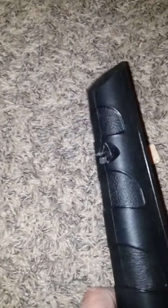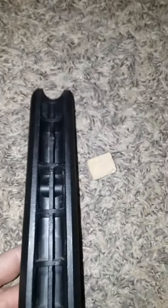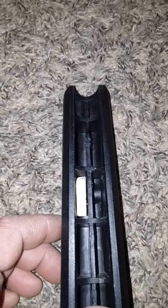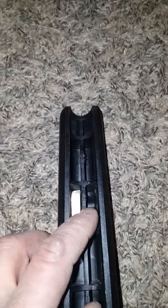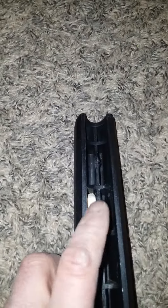I got these little chunks of wood here. What I'm going to do is put a couple of those in there, epoxy them in, and then shave this off on the bottom here and fill it in down here. Get a little meat in it with some wood and epoxy, then hopefully this smoothed out down here — take this off and punch a hole in there and have enough meat.